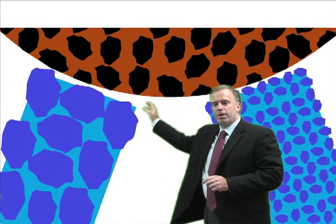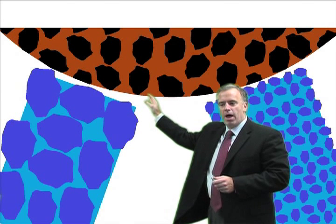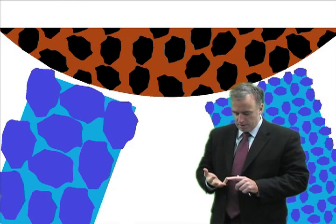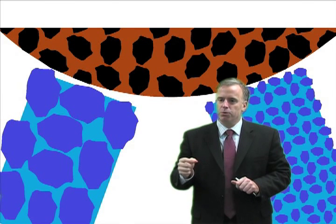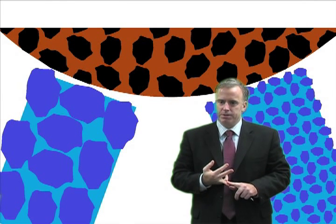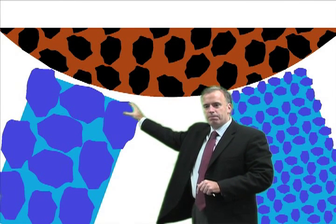If we take a resin-bonded diamond or CBN wheel, or metal bonded, after we true the wheel, the grits do not protrude above the bond material. So we've got to stick the wheel and make space, or clear out some of that resin or metal bond. Okay. We have a certain grit size in there.